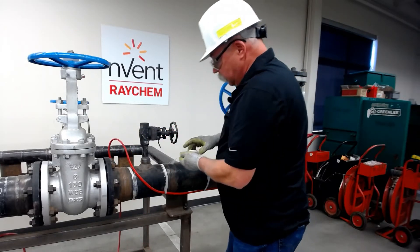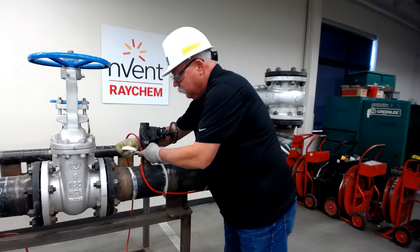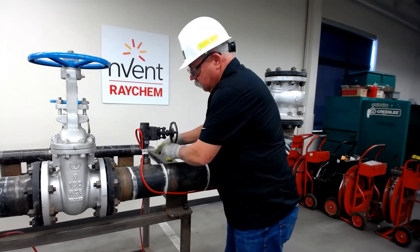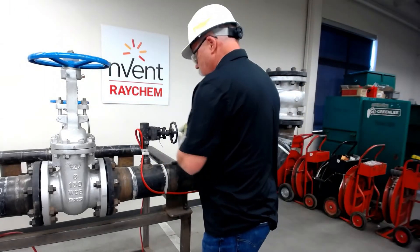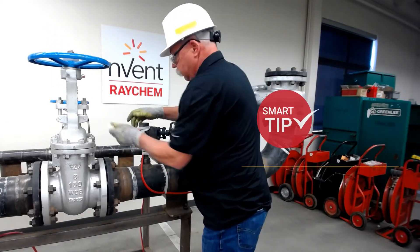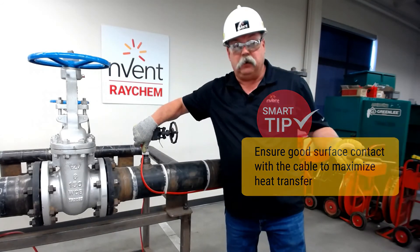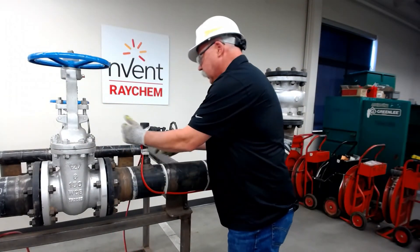For a quick install, I have my tape. Wrap it around. I've done my pre-bending, and up high it has to come — like that. We want to make sure we have good surface contact with our SR cable. If we don't have good surface contact, we don't get heat transfer, and therefore we're wasting our heat. Once that's installed, I double check to have a look, and if I'm happy with it, that's good.